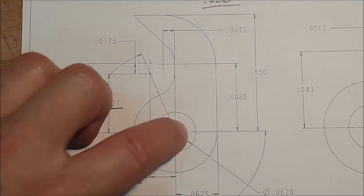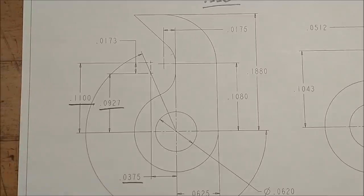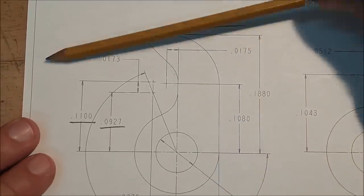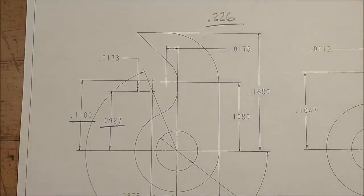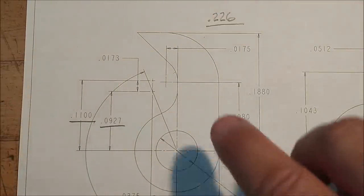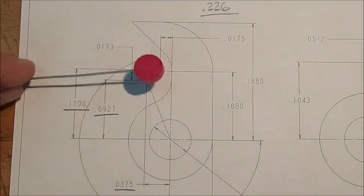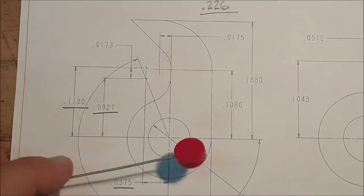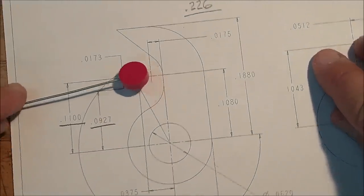I'm going to drill a hole on size, and I will use that as the center of the universe. I can take a cut up the outside to bring that edge in. I can take a cut across the top to bring that edge in. And I can take the end mill that I used, since the radii in these two corners are conveniently sized. I can plunge here. I can plunge here. I can walk them together, and then I can spin the part in the rotary table all the way around to the tangent point here.